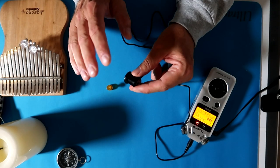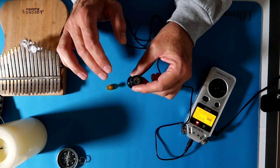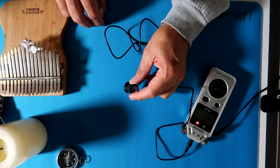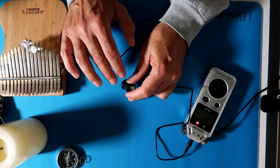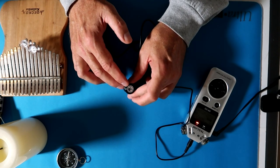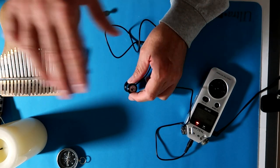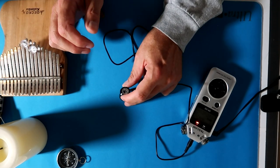All right, so there's finally a case where it seems like a little calculus would be helpful for this type of thing, but I'm not going to really address anything specific other than to say that the first derivative of the magnetic field with respect to time is what induces the current in the field coil, and then that makes a voltage that becomes a signal in Audacity or whatever you're looking at it in.